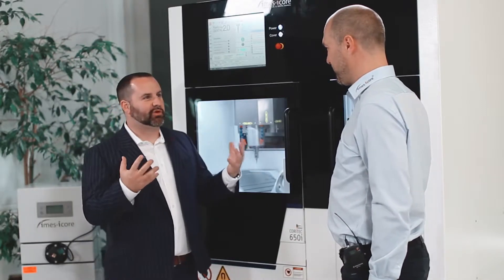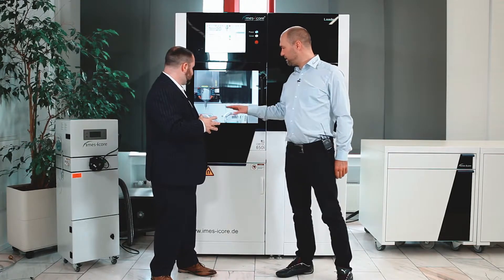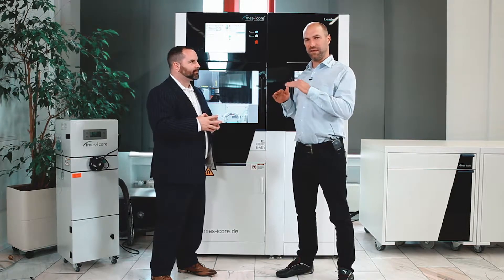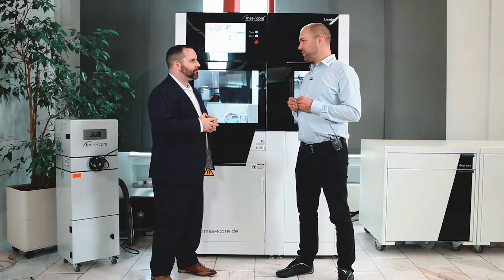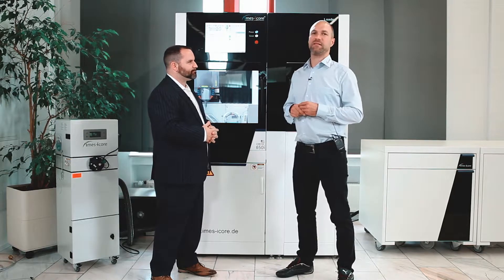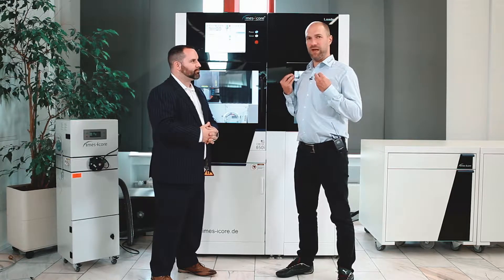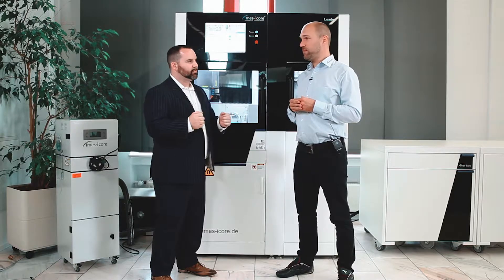What makes this machine so robust and special? In the mechanical part of the machine, we only use granite components — the granite base, with X, Y, and Z axes for movement, all components made out of granite. We're using linear motors and linear scales in the linear axes, and in the rotation axes, A and B, we have torque motors. This setup with the granite and the motor technology means we're using the heaviest and strongest components available for milling machines.